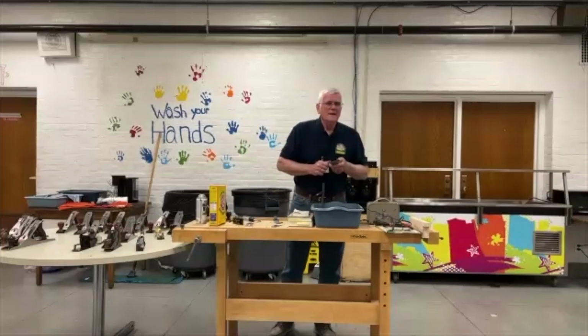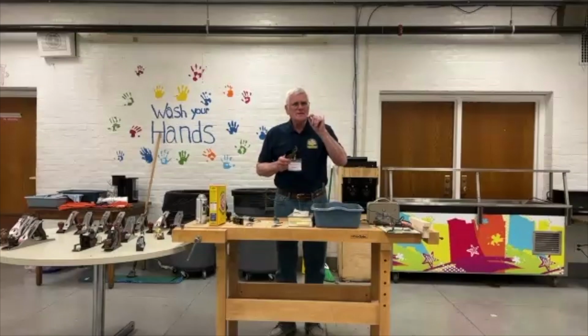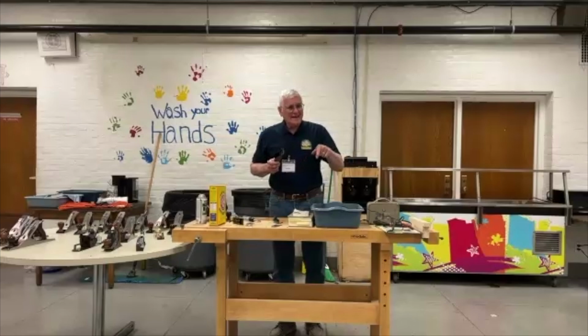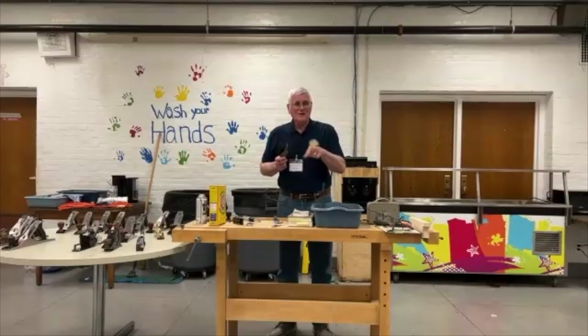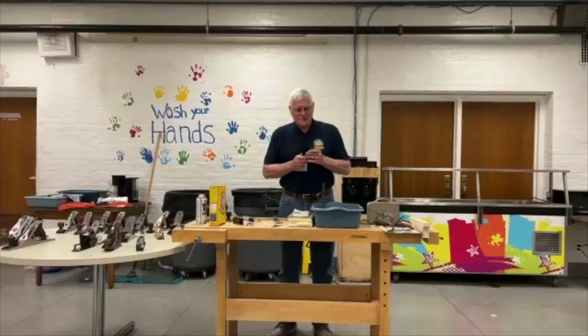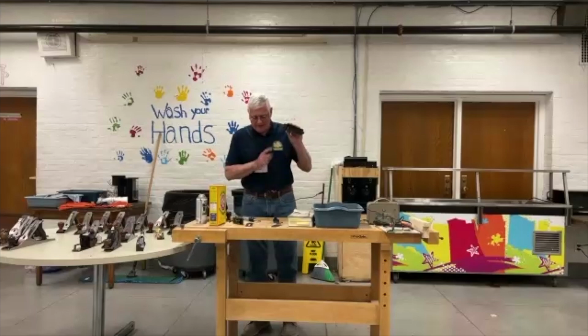Pardon me? What is Japanning? It's something they used back in the 1800s. It's linseed oil, it's iron filings, it's paint. By paint back then, it was lacquer. And there are some other ingredients I bought, and you mix it together and you got to heat it, and it's flammable. Not a good idea. I went out in my backyard when I did it, and my wife wouldn't let me go anywhere near the house when I was trying this. But Japanning gives a very hard coat, and I have nothing here except for this that has Japanning on it because I haven't cleaned this one up yet.